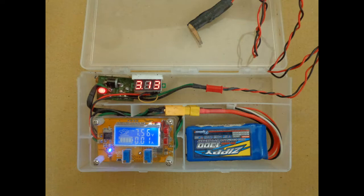I don't use the USB port — I'm strictly using it for capacitors. If you're a nitro flyer, you could also use it as a glow plug driver. You could set the voltage and it would show you the amperage drawn by the glow plug. You could note what a dry glow plug pulls and as the plug gets wet, it'll draw more amps — so you could diagnose a flooded engine or a burned-out glow plug.